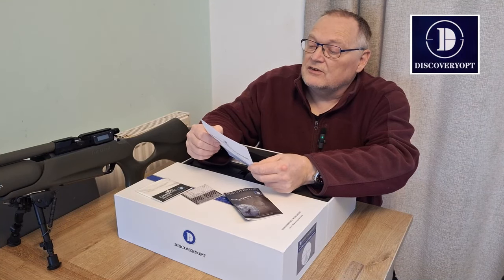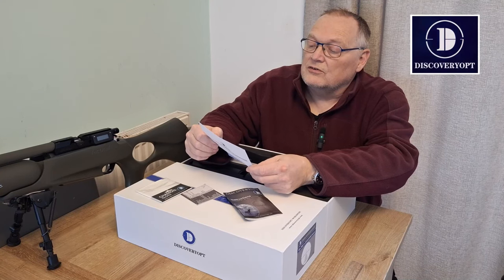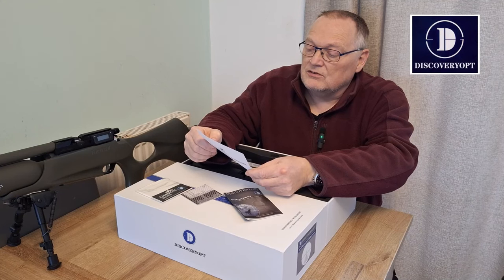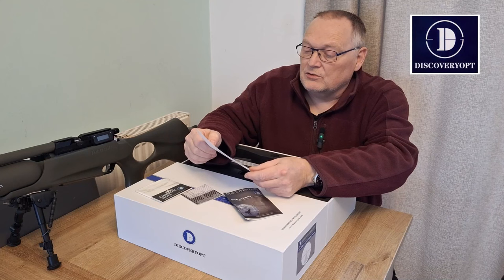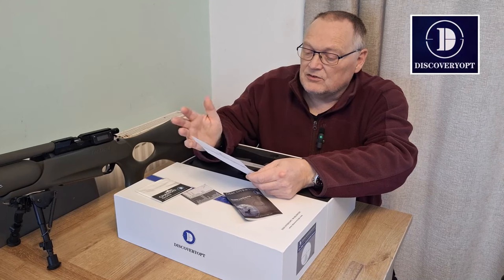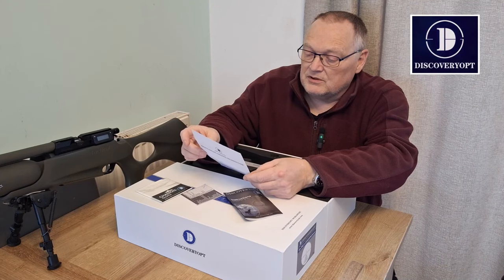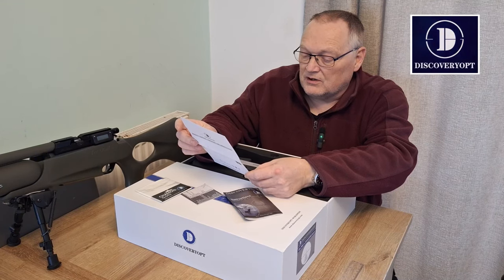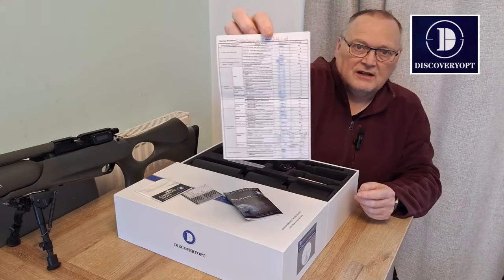So checking for air leaks, test equipment pass, scratches and oxidization color pass, shim screws inspections pass, markings and reticle etching all correct, horizontal impact no shift, vertical impact no shift, components seated tight, no movement sound, reticle no scratches, dots and dust, fixed lens no scratches, dots and dust, ocular lens set no scratches, dots and dust, objective no scratches, dots and dust. To go right through it: the lens, the refraction adjustment, magnification knob, parallax knob, illumination adjustment knobs, reticle magnification knob again, parallax knob, adjustment knobs for eye focus. So thoroughly checked out there.